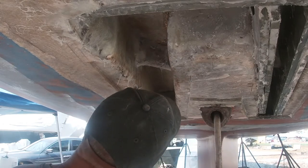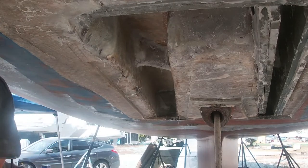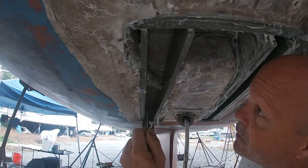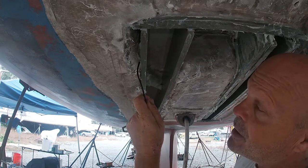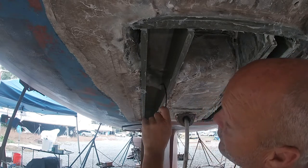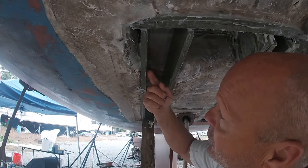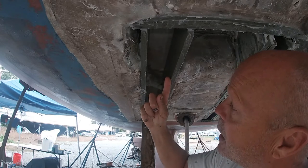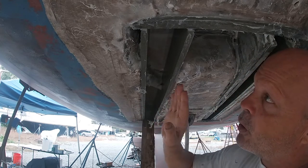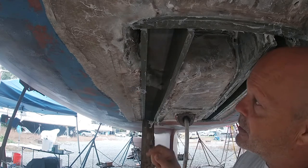That's just one layer, and now we're going to epoxy the board to it. We've put up a layer of 1708 fiberglass here, a layer of 1708 fiberglass here, and these beams have been epoxied. The next step is to take another piece of fiberglass and loop it all the way around from here over to here, same on this side — we'll do two layers. Then we'll go ahead and put two more beams in, epoxy them, and then we're done except for putting the bolts in.